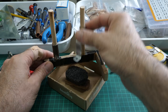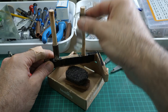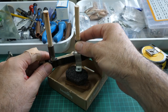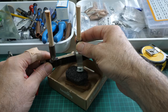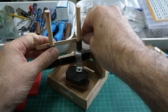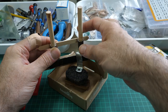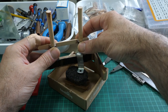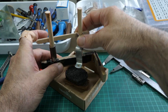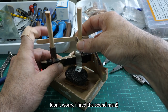So what I intend to do is make a little device that can attach to the pattern, and then I can lift it straight up vertically. So in its current arrangement, it's pretty good. You can lift it straight vertically. But there's nothing to stop me accidentally swiveling. So I suggest an extra rod and a beam, and then when I get this all ready and attach it to the pattern, I clamp these two together. Imagine this, I haven't got enough hands and it's very light and flimsy, but that means that bad rotation can't happen now. It can only go directly vertical.